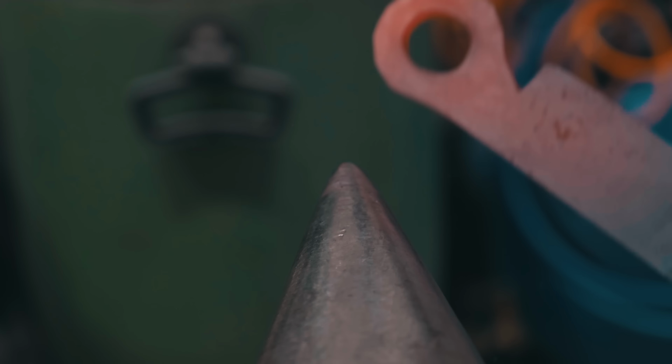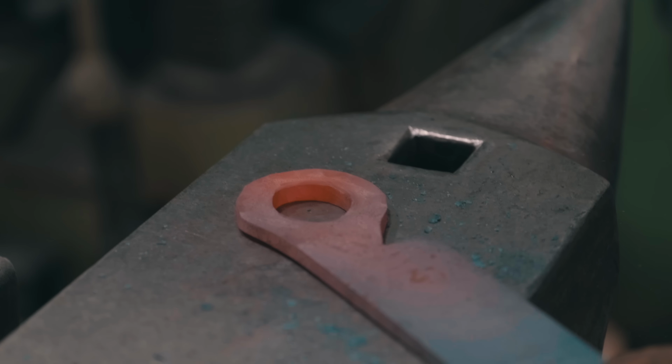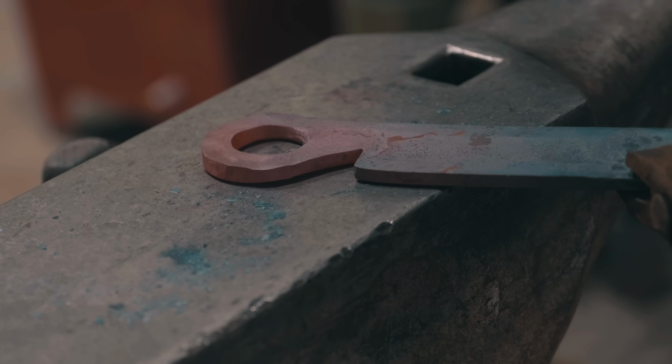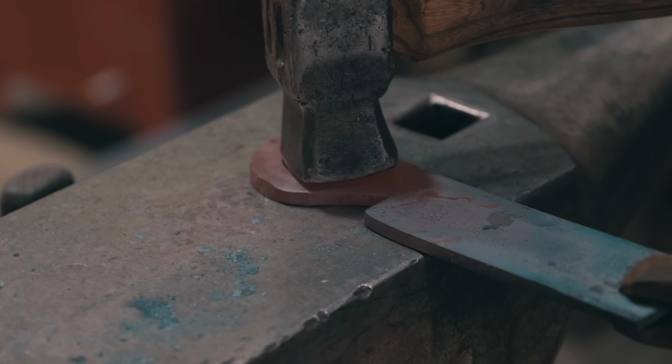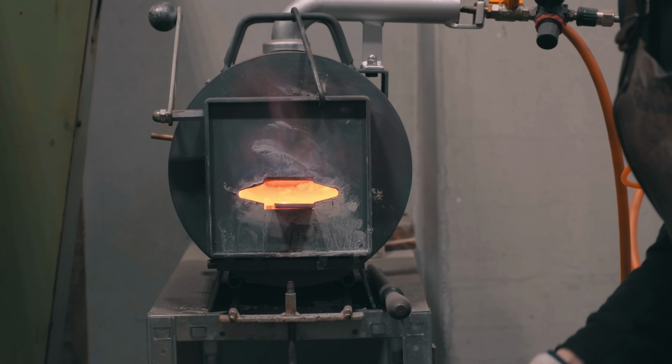I'd say forge at as low a temperature as possible and as high as necessary. That's usually a good rule, in that it can damage the steel to forge too hot. So it will move easier, but if the steel isn't any good afterwards, then you miss the mark.